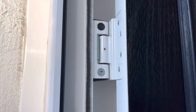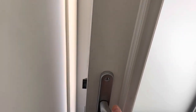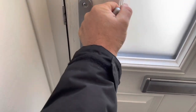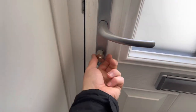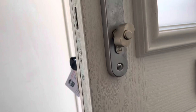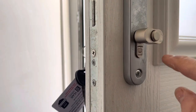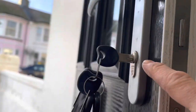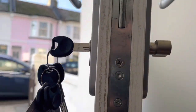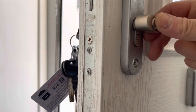I'm going to try and adjust these for the lady so we can get it working a little bit better. Alright, we've done the adjustments — it's now not catching. For those that were asking — I know this was on a forum the other day — I actually phoned up Apex to find out what the button is. If anybody did attack the cylinder from the front, you're still able to get out using the thumb turn by engaging this side with the button.